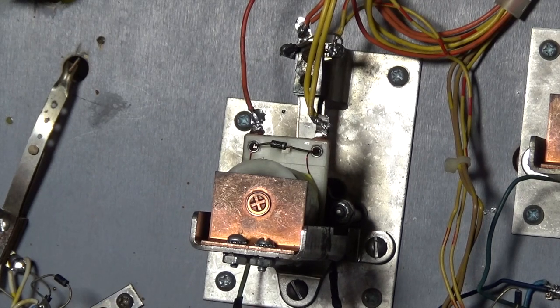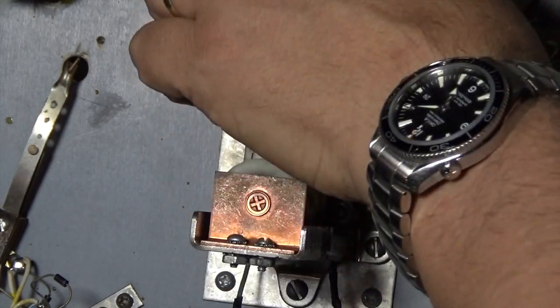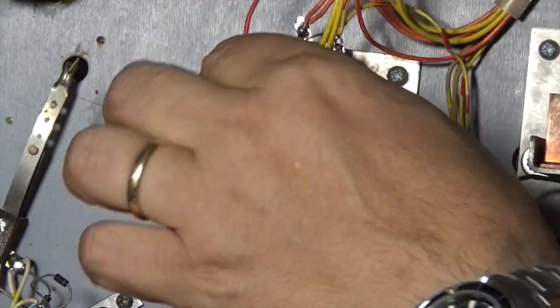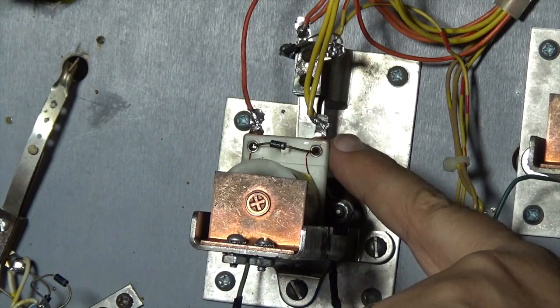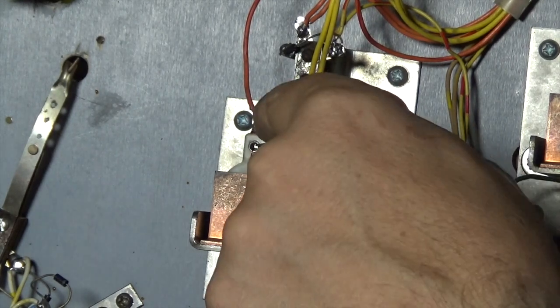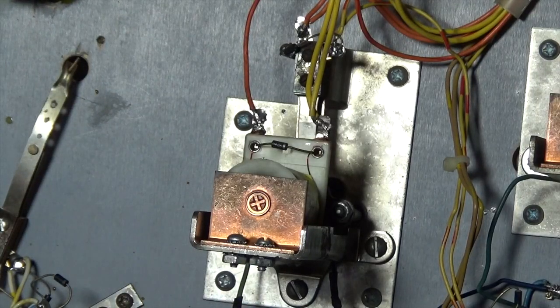So I thought I'd do an explanation of how these solenoids get fired. Effectively, on most machines you have the following. You have a positive lead which brings the 50-odd, 60 volts to the solenoid, and then the circuit is completed, which energizes the solenoid by grounding it. So this is continuously on, and by triggering a switch, or the driver boards, in fact, they will come through with the transistor. The transistor will complete the circuit to ground, and then the energy can flow.